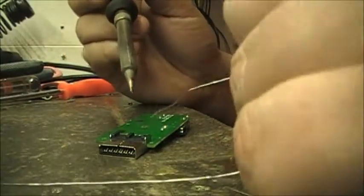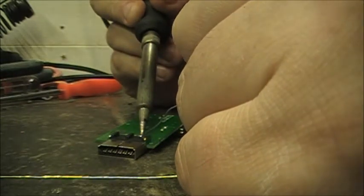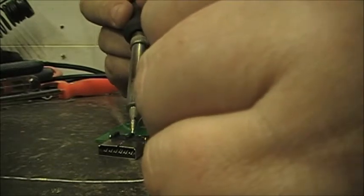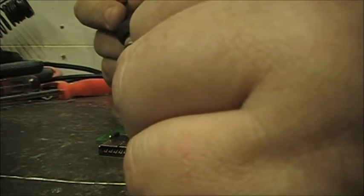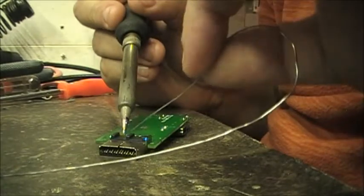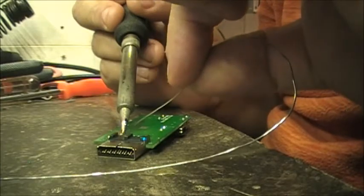But first, we have to re-solder this one. I've got one side done, I'm going to re-solder this side. I think what it is — they're soldered, but there's not enough heat when they do the soldering on these pins. I'm leaving the tip of the iron on a little bit longer, just to make sure that the pin is taking the solder.